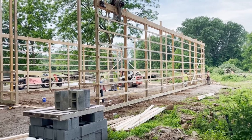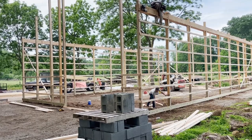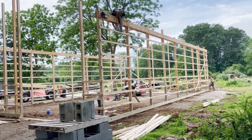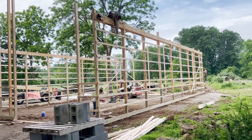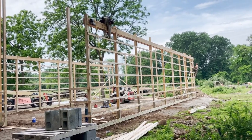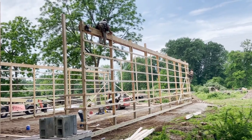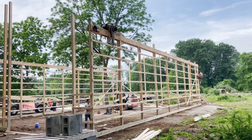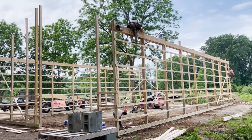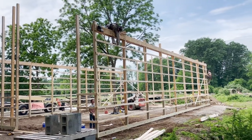Morning of day two. They've got all these battens on everywhere that the siding will be attached to, and they're putting the cleats up top there - those will hold the trusses to the building. Actually every post is also notched so that it holds the truss every 8 feet directly on the post, and the rest of it's on that 2x12 header. He says today they'll have all the framing done, and probably tomorrow wrap the building and call it a day.